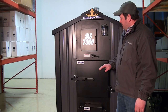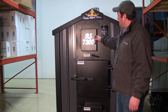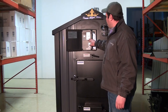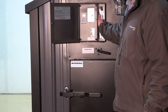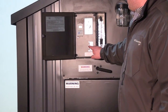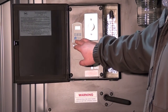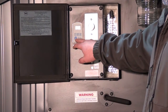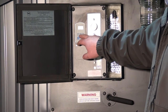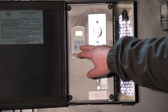The first thing you're going to see here is three doors when you walk up to the stove. The first door is your control panel, your access panel. It's got your water fill tube or your water site tube. It has an on-off switch and it has a rheostat and an aquastat. The aquastat is a digital RANCO that controls the water temperature inside the water jacket and kicks the blowers on and off.